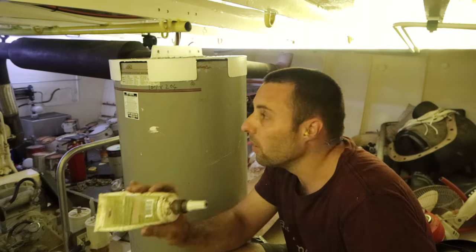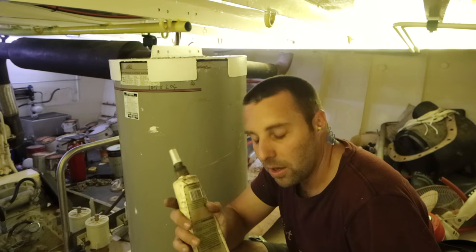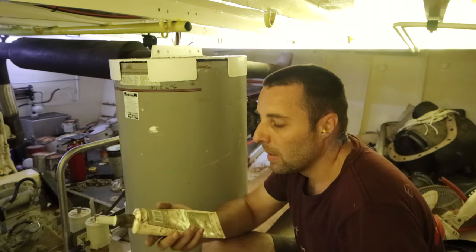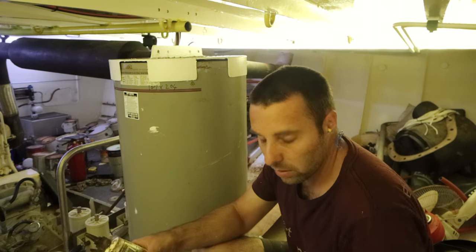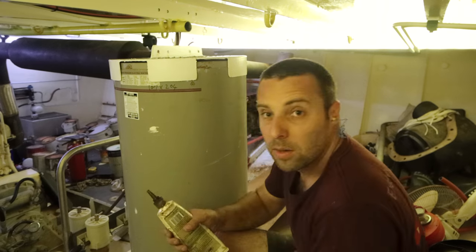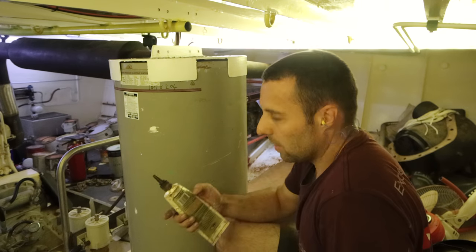So put a bit of copper coat, smear it around. As you squeeze all the bolt together and everything, it kind of goes out and fills up all those gaps. Also helps in being able to open that bolt later on, 10 years down the track, when you need to undo it. So, especially because I'm doing stainless bolts, we all love galling. If you haven't experienced galling on stainless, get a stainless nut and bolt and tighten the crap out of it. See if you can undo it easily. Stainless loves to bind up on itself.